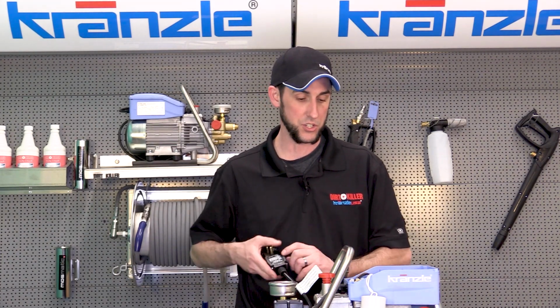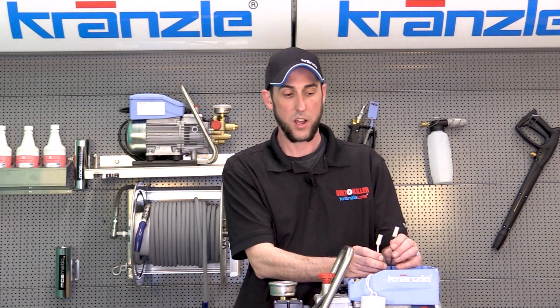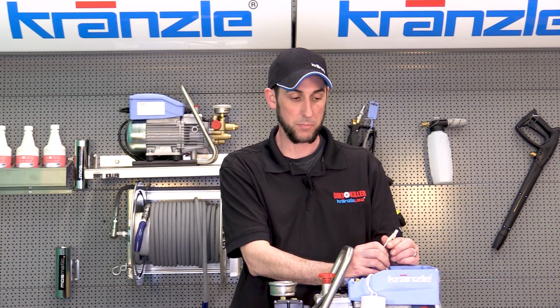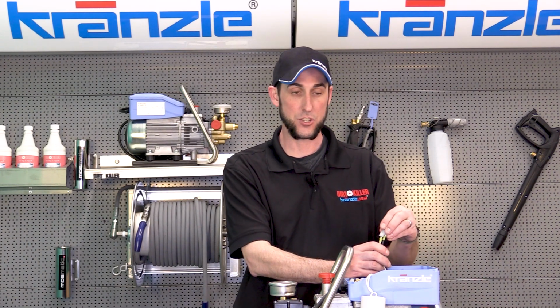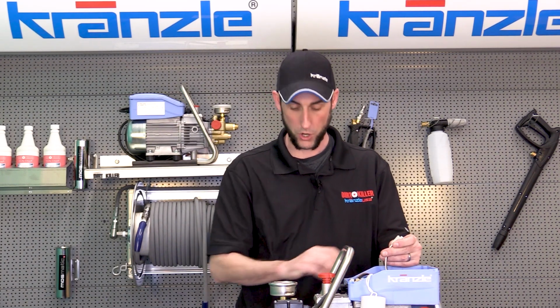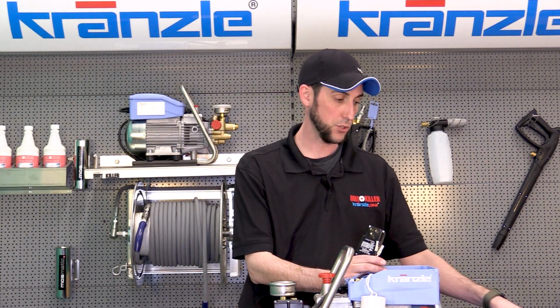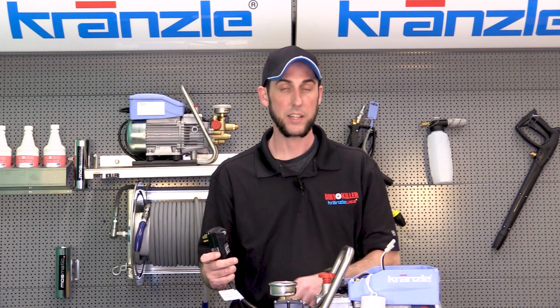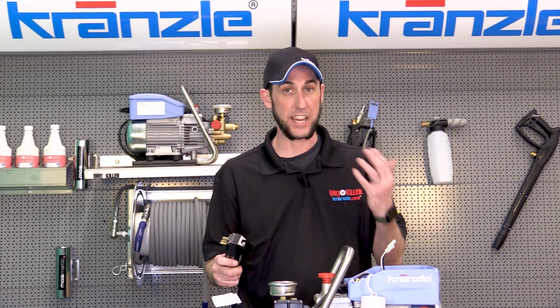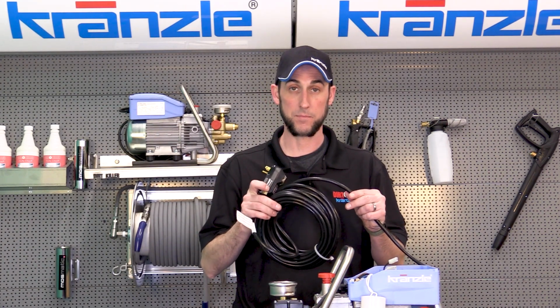First, unplug the GFI from the receptacle. And we're going to remove our hot and neutral from the on-off switch. And we're going to take a multimeter and test these 2 terminals for current when we plug this in. So once we have our tester plugged into the actual terminals safely, we're going to plug in the GFI and press the reset button.